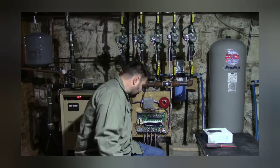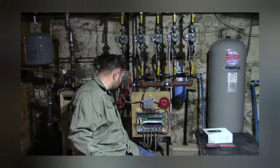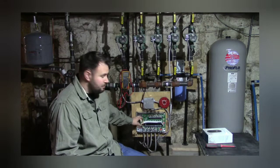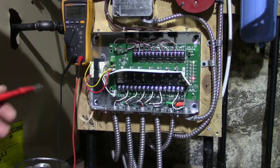There is a fix, and that's what we're going to talk about today. With our current wires we can't use the thermostat, so I bought a big roll of 18-3 wire. What I'm going to do is snip the wires going upstairs, use the old wire to fish the new wire back up, then wire into a neutral — the common — on the board itself, and run three wires up so I can run the thermostat and have the smart home I want. Stick around, I'm going to go through the steps.